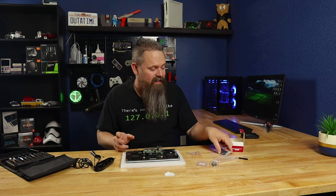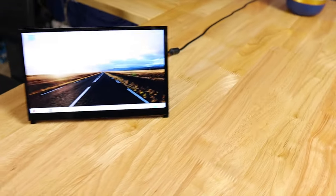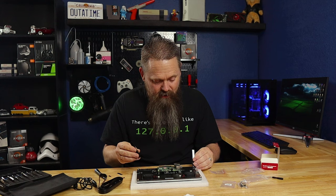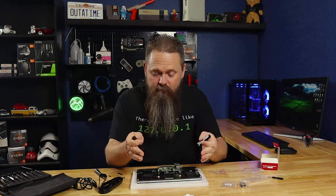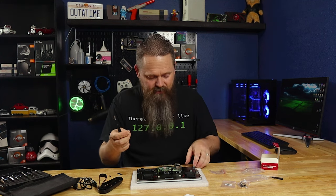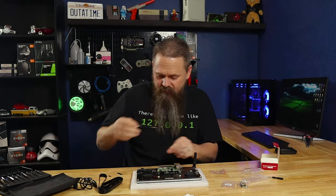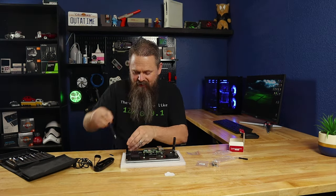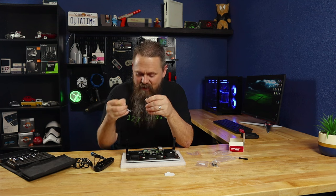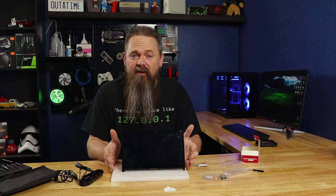Now this thing needs to have legs. It comes with little legs that are 3D printed — they're kind of cheap-looking, but they definitely do the job. You want to mount these so the legs are pointing up, giving the monitor a slant. Take the screws provided, stick them through the little hole, and screw them right down to the standoffs on the PCB, then repeat on the other side. It also comes with little rubber feet that you put on the legs so it doesn't slide around. Now all we need to do is fire it up and see how it runs.